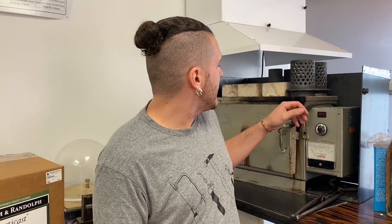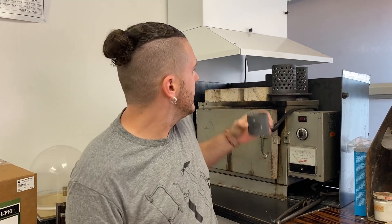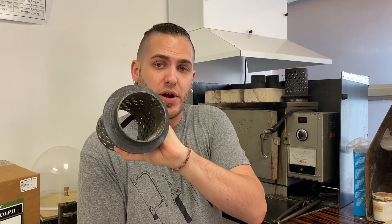As we mentioned before, unless you have a very specific investment designed for a rapid burnout, the overall process should be taking you eight to twelve hours — there is no way you can get around it. If you're doing a small flask like this, eight hours should be very sufficient because you can only fit maybe two things in this flask. If you're dealing with more production size stuff — this is a four inch by six inch flask — this is going to take as long as you can possibly get. The bigger you go, the longer your burnout needs to be. We've just been using PlastiCast as our example; however, if you're using something different, make sure you look at the manufacturer recommended schedule and adjust accordingly. With lost wax, you can use those guidelines pretty much as they are, but if you're doing lost resin, you will have to adjust them most likely. Adjust your hold time, not your maximum temperature.